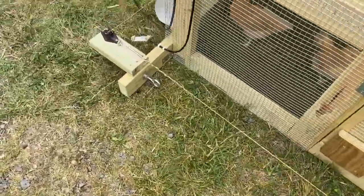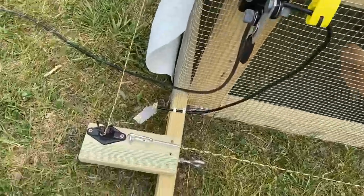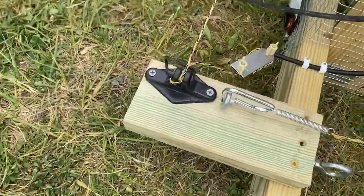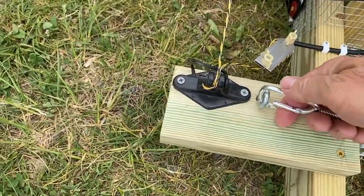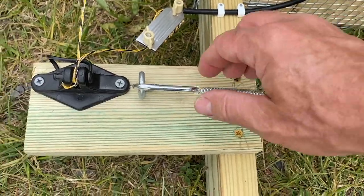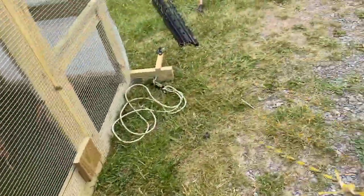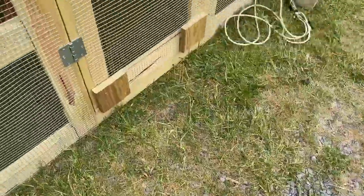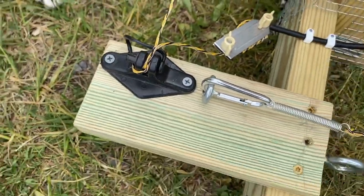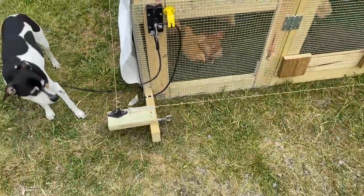On this side, the wire is six inches off the ground and would hit the door, so what allows us to open the door is to turn the fence off. With it off, we're not energized. On this string up front I have a scrap spring and a hook — I forget what these hooks are called — so I can remove the string here and set it aside. We are off in the front, and it's very easy: my wife or my daughter can connect this back up. Once connected up and the button thrown down, we are fully energized all the way around.